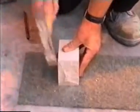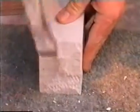As it is only a soft brick, we can use the comb hammer. Combing can be a tedious operation, but don't rush it. Never comb directly on the face — comb halfway, then turn the brick around and comb again.